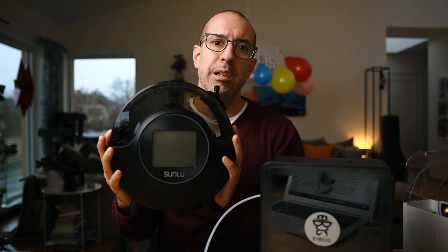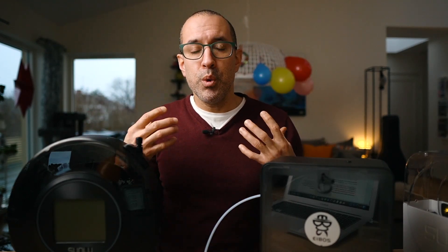Something that's been brought up by many in the 3D printing community is the fact that neither Sunlu box has a fan. When you're drying something that is very wet, you get condensation as the water leaves the plastic, and since everything is enclosed, that humidity just stays inside and returns to the filament. So ideally you need a fan pushing that humidity out of the box — and that's where the third box I bought comes into play: the A-Boss.